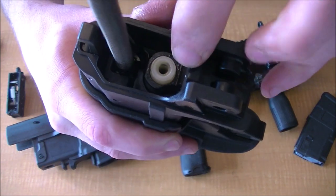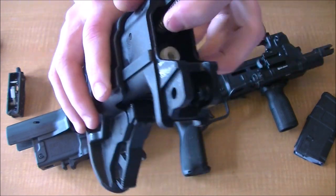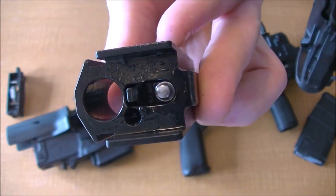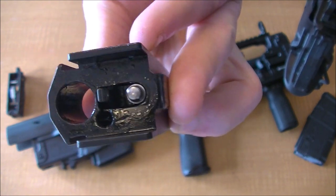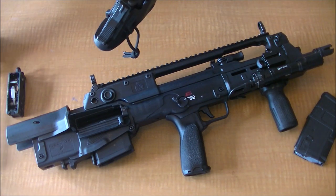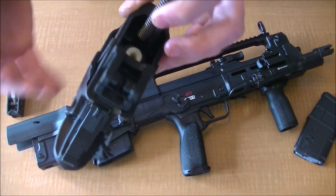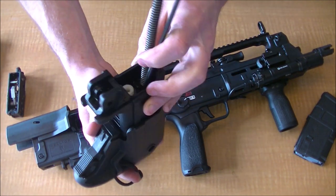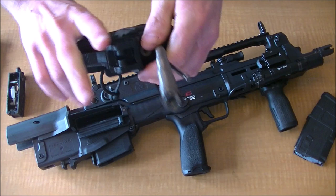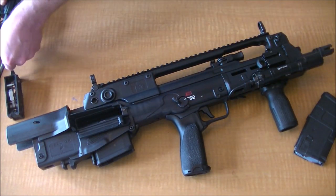Next is this nylon buffer here, just like the G36. The back of the bolt around the firing pin will actually impact this, and there is slight wear from it impacting — you can kind of see that little moon shape or circle around the firing pin. You can see where it impacts this nylon buffer to cushion the recoil, and I think that's one of the number one reasons why this thing has such little recoil: it's buffering so early on. We're going to get to the trigger pack next.